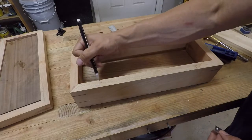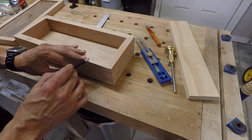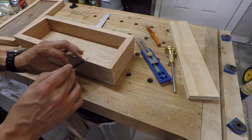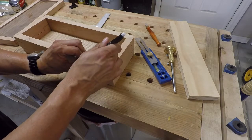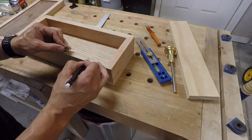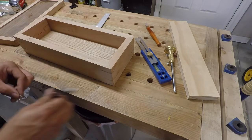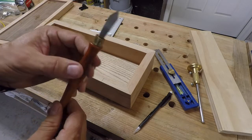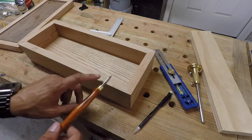Another reason to line this portion up - the top of the hinge - is so that my cut line does not pass that portion. I know my hinge is not going to be over here, so I want to make sure my knife does not pass that line. I'm going to get close to that line but not go up to it, because I don't know if my hinge is actually going to start or end about a sixteenth of an inch below that top line. This is a marking knife - there's a beveled edge on one side and a flat edge on the other. You want to press the flat edge against your marking tool.